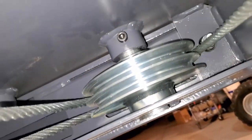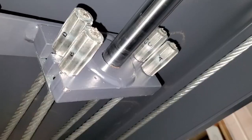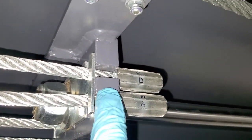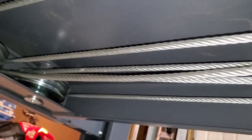Running the longest cable into the passenger front area, we followed the same strategy — fed it through the cross tube into the post, making sure to stay on top of the brackets. Some cables run on one side of the cylinder, others on the opposite end under the runway platform. Once worked into the hydraulic bracket, the little safety bracket keeps them in place. They're difficult to work in if the cylinder is not fully extended. We labeled and routed all cables as the instructions indicated.